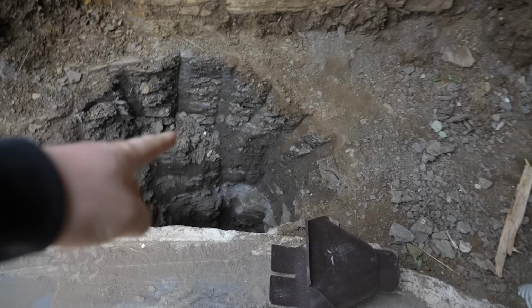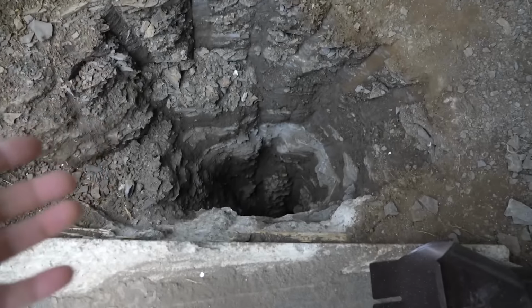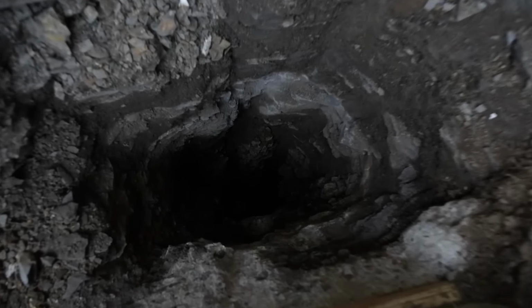Well, it's the next day, trying to pick up where I left off. I did not expect digging this hole over here to take 4 or 5 hours. Here we dug a hole to take all of the water that's coming down this path here and to dump it underground. You actually can't see. Behind that wall is an empty space that we will add a gutter system to take all of the water we collect, run it behind the new room out away from the house.